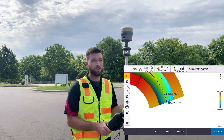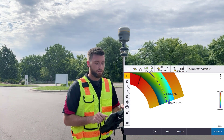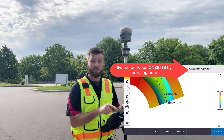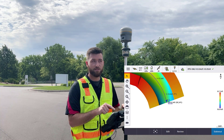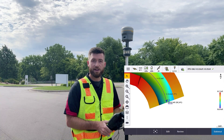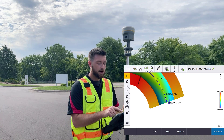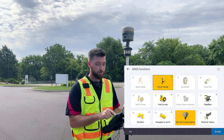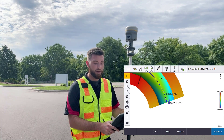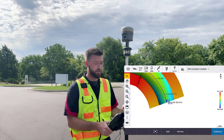What's important is that you start the stakeout in GNSS mode. I'm going to switch over to GNSS — I can do that by tapping on the angles at the top right-hand portion of the status bar. That's the quickest way to switch between GNSS and Robotic Total Station mode. So I can just tap that area of the status bar. Now that I'm in GNSS mode, one thing we can't do yet is utilize the IMU Tilt Compensation, so I'm going to turn that off. Perhaps one day we'll be able to use that in this mode, but today we cannot — so I'm going to disable that altogether and run this as just a traditional RTK rover.